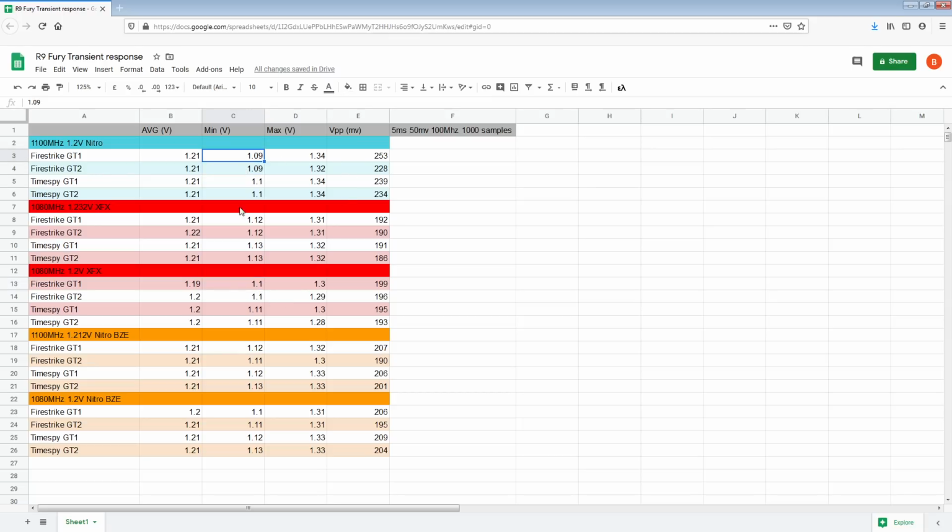Anyway, the results still make sense that the XFX card would actually beat the Nitro. I was honestly hoping the Nitro would beat the XFX card, because it is a custom PCB, and Sapphire did make some upgrades to the PCB which are rather nice. They went from direct FETs to power stages, but the problem is that it seems like Sapphire optimized their VRM design for thermal performance and efficiency. Getting really good voltage regulation performance tends to be expensive, so they were just like, nah, we're not bothering with that. So the results here make sense when you look at the PCBs.